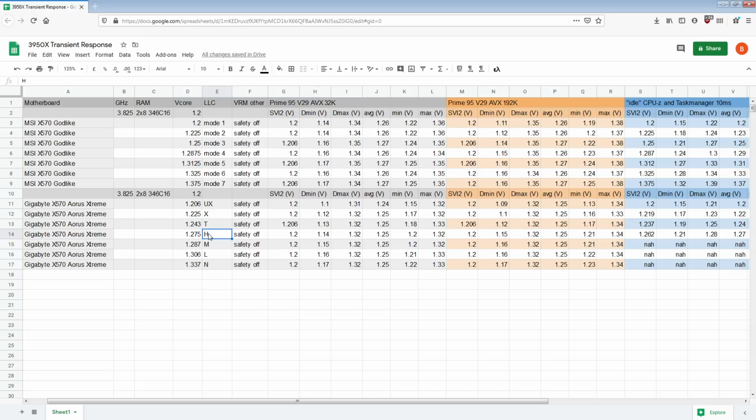At the same time, I think most of the modern voltage controllers are somewhat idiot proof. If I really screw up the configuration, the undershoot and overshoot will be horrible, but it won't let me destroy the chip, hopefully. That's my main concern, that I screw something up and break the chip. It's fine for me to fiddle around with changing switching frequency and load line settings. That's not really a big deal. Fiddling with the actual compensation settings is where I can really screw something up.